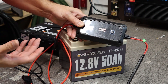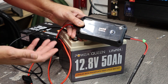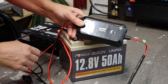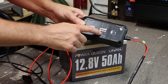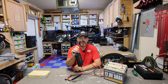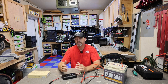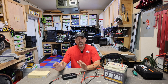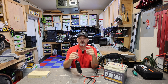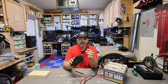This thing also comes default with a boost charge of 14.4 volts, and you can go in and actually change that too. Some people like to boost charge their LiFePO4s at 14.6 or even 14.8 volts to make sure all the cells are balanced. For this demonstration I'm going to keep it at 14.4 volts, but just know you can change the charging parameters on this little guy. Now that leaves you with one open end with an SAE connection. Depending on your application, some solar panels have MC4 connectors, some have XT60s, some have Andersons — just check what type of connection your solar panel has. You can go to Amazon and type in SAE-to-XT60 or SAE-to-MC4 and find the right adapter cable.